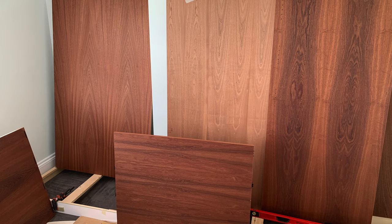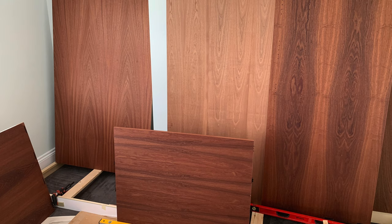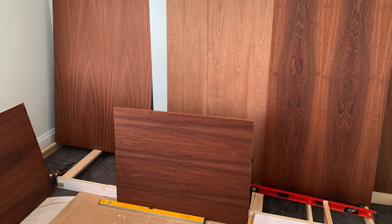The legs bear either against the floor directly or against small squares of MDF or plywood that I screw down through the bedroom carpet directly into the floor. This really compresses the carpet down and makes for a much more stable footing. I know some guys like to cut the carpet away and let the feet go directly through to the floorboards, but I try to avoid damaging customers' property too much even if it's going to be under a wardrobe. With the plinth fixed I can attach the pre-painted toe board — this is just a 6mm MR-MDF strip scribed to the floor and glued in place, and it's much easier to do this before the carcasses go in.